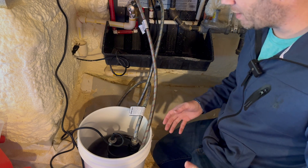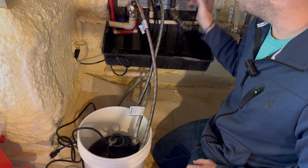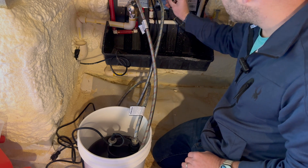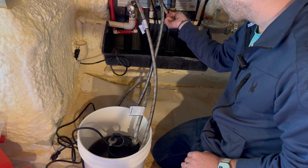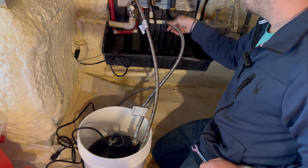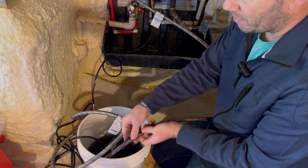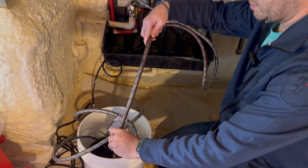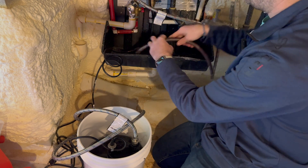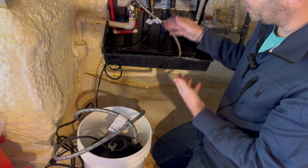It's been 45 minutes, so now it's time to unplug the pump. Now we're going to rinse the unit out to get the cleaning solution completely out of the water heater. To do that, we're going to close the service valve on the cold water inlet side and disconnect the blue threaded hose. Then remove the red threaded hose from the bucket — be careful not to get this on your clothes — and place it down in the drain pan. If you don't have a drain pan, you could use a bucket and empty it periodically.